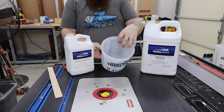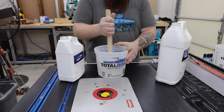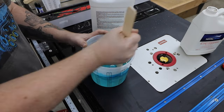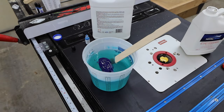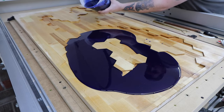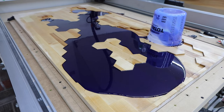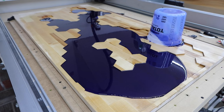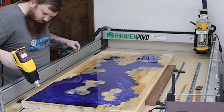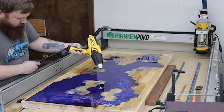You're about to see me make a series of mistakes that really threw this project through a loop and had me banging my head against the wall for a few days. It's absolutely vital that you follow the instructions on the back of your epoxy. These mixing cups really help you get the right ratio if you fill them to the right lines. This should have been a 2-to-1 ratio — I went a little heavy on the hardener. There are different epoxies for different situations. This pour ended up being just a little over a quarter inch, and I did it in one shot — that's pushing it, and I probably should have done it in two pours. On top of that, I probably used the heat gun a little too much and overheated the epoxy. I went a little heavy on the pigment, and it ended up being a lot darker than I wanted. I tried using some alcohol inks to lighten it up a little bit, but this really didn't turn out the way I wanted either. The takeaway from my frustration: take your time, have a good plan, follow the instructions, and don't try to cut corners.